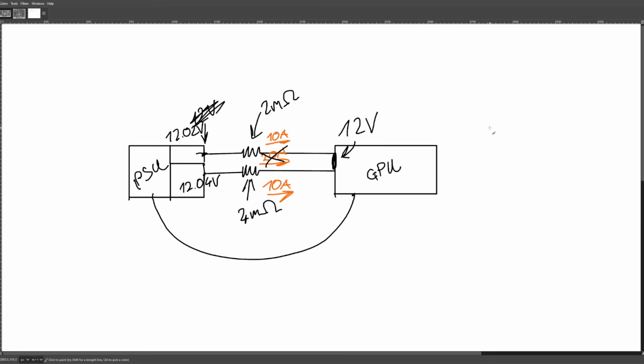And actually, even current gen AMD GPUs work that way. A 9070 XT still doesn't have any current balancing circuitry. Why? Because they just don't enforce a power limit that's as strict as NVIDIA does. The 8-pin is not going to melt if you overload it by 30% every so often. Actually, it probably won't melt even if you overload it by 200% continuously. And instead we get the 12-volt high power connector, where finally we can get rid of all of that optional current balancing circuitry that we, for some ungodly reason, insisted on putting on our GPUs, and now the connector's a problem. You didn't need that current balancing circuitry in the first place, and the connector is a problem.